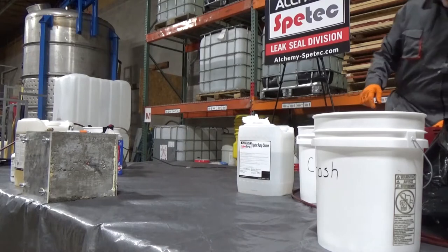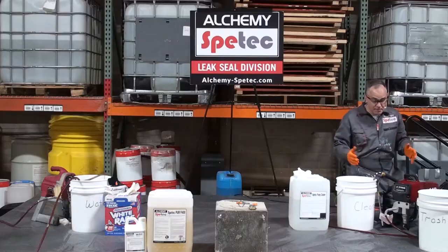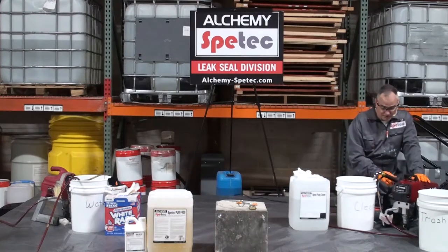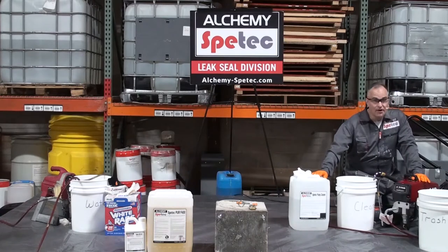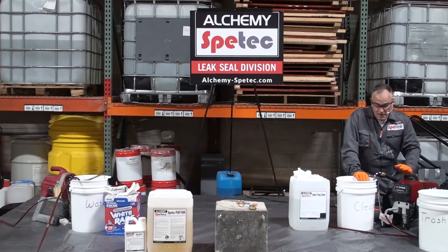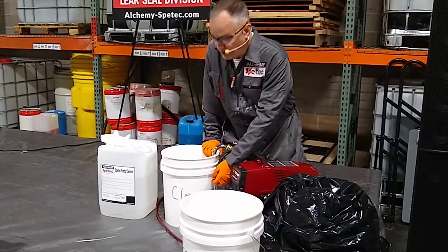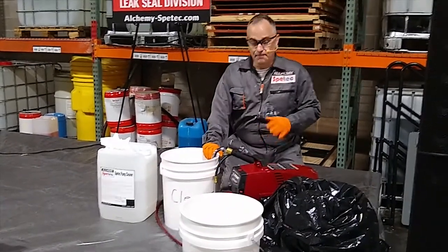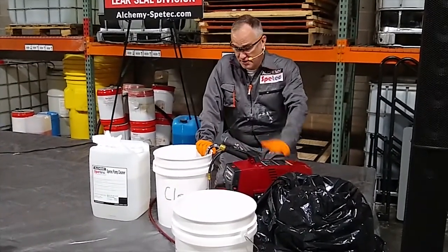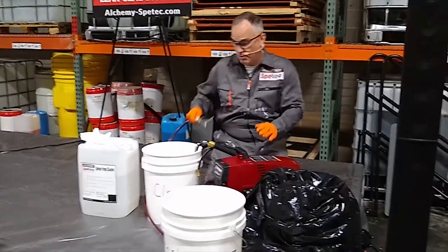Airless paint sprayer — standard setup. They've got a valve on the side so you can prime it. I typically don't like to use the prime line, even with cleaner, because the grout is water activated and will take humidity out of the air. If you're grouting all day and use the prime line, you'll end up with grout in it and potentially clog it up. These pumps are great and should self-prime.